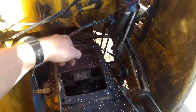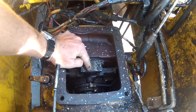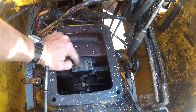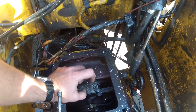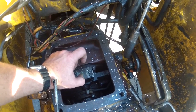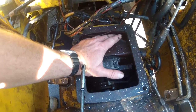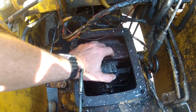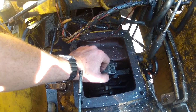I think I mentioned in the first video that the guy I bought this from said the valve body was bad. I had gone through and taken this valve body off — you take off these four bolts, then take this top plate off with these two screws. There are these plungers with springs in there; the plungers appear to be good. I replaced the springs with brand new ones. But under this there are these two little pins, and the pins are what open and close channels for the fluid to run through. Even my local New Holland place couldn't get those pins — I had to order them off the internet. They were about $18 a pin, which is fairly substantial for two tiny little pieces of metal.